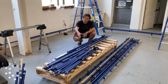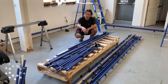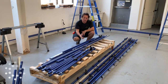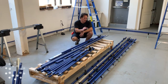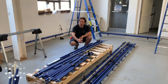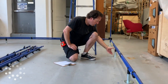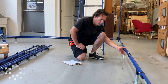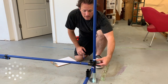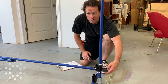The joy of this system is that it breaks down and can be put on a skid for storage in the winter or the off season. This is an eight-foot long skid, and the pieces can be broken down as far as six feet, which makes it pretty easy. I've put the skid on wheels so it's easy to maneuver when you need to. The base of the cage sits on feet which makes the height slightly adjustable, reinforced with a double pipe to add rigidity for the entire structure. The vertical corner posts can be adjusted for height to compensate for uneven ground conditions, which you'll find in a garage or a warehouse.